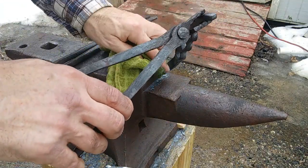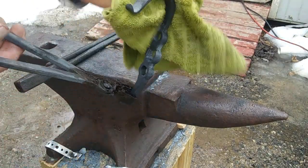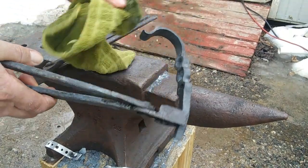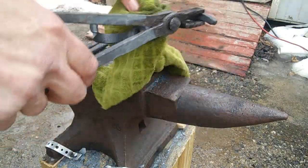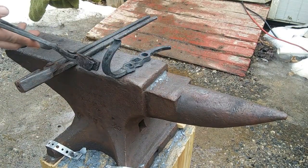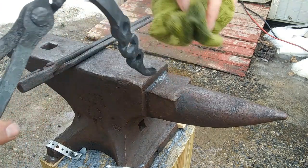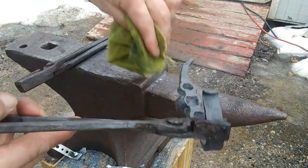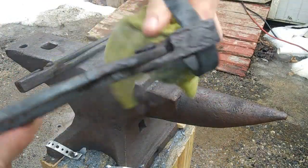The trick is to get it on everything. Now if you were to do something for the outside, you'd probably want a different, more heavy-duty finish. But since this is probably going to hang on a wall inside, we'll go with some plain old oil. Still a little warm, but we'll keep applying oil as she loses heat. I really like the way this looks - it looks really nice. I like the good old wrought iron look. Forged metal.